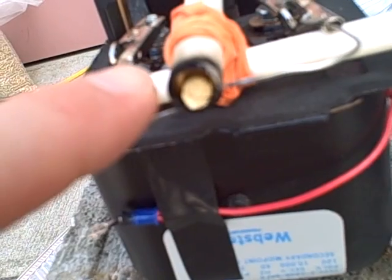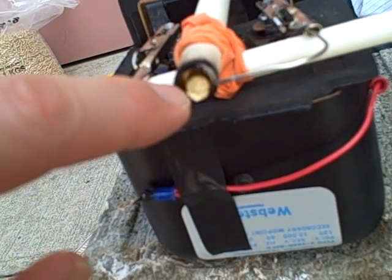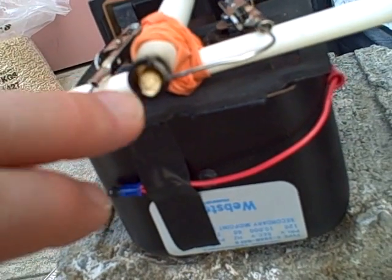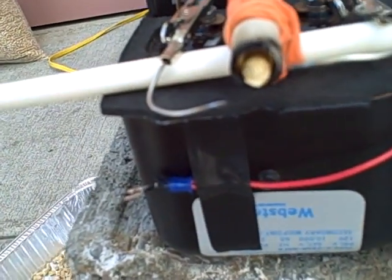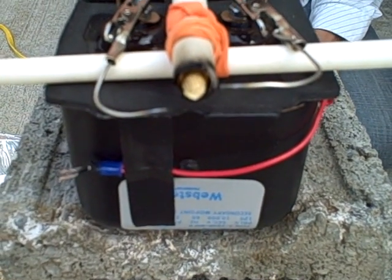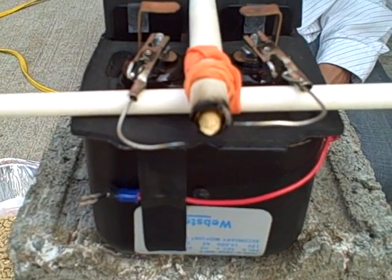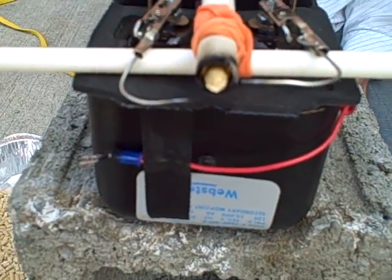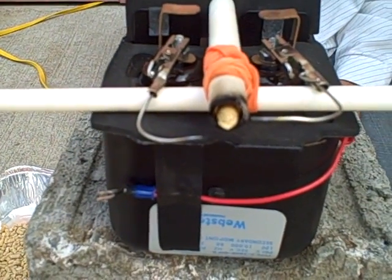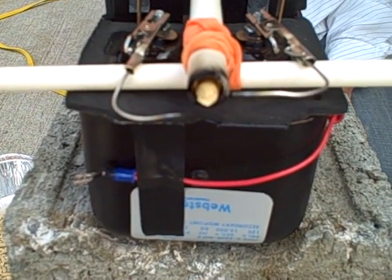You can see right here at the edge of the ceramic it appears there might actually be some tar — I see a little bit of a shiny sheen to it, as opposed to the dull finish of the powdered carbon. It kind of feels sticky, like it might be tar. One of the hopes of plasma gasification is that the arc temperature would be hot enough that tar would not form. But as we can see, our arc is not very even and certainly not covering the whole surface of the wood. This could take a little more development. For the small amount of power we're dealing with, we may have to use smaller quantities of wood pellets — maybe sawdust instead — to ensure full gasification, very high temperatures, and reduced tar.